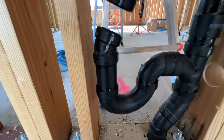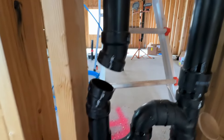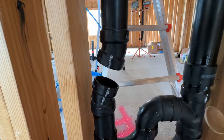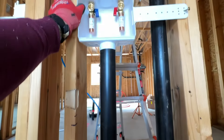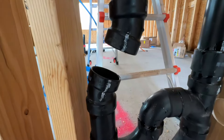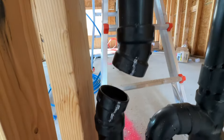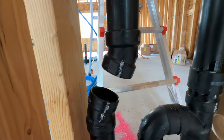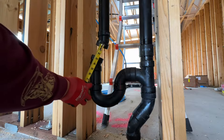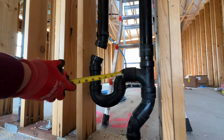Because I am going to have to jog the pipe over a little bit, I have my 20-degree fitting right there with a little bit of a straight section so I have some straight flow. I need to figure out what that distance is — I knew it wasn't going to be completely butted up. So I'm holding this in place so I have that proper offset, and I can align it to see exactly how far, then measure between those two pieces and cut that splice. Looks like we're going to be at three and a half inches.